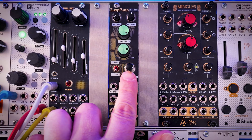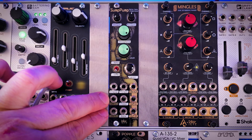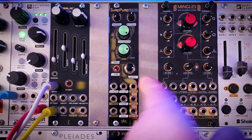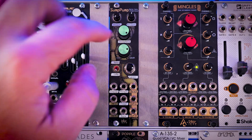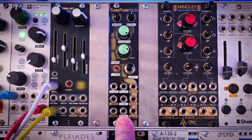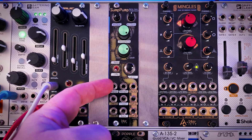You have an internal level control right here. This switch lets you switch between gate mode and compression mode. As I said in the intro, it's a stereo compressor — so you have a left and right input and a left and right output. You can also take the envelope out for modulating other things through CV. You can modulate both the threshold and the floor. And there's an input for ducking, or you can just trigger the envelope yourself by plugging into the engage input.